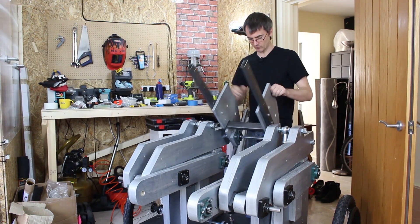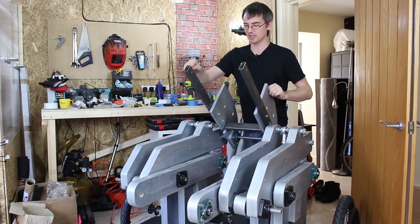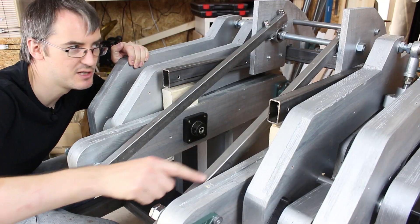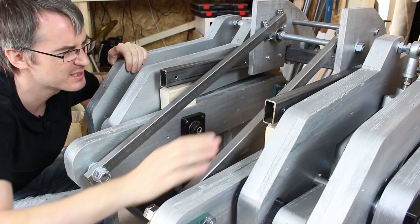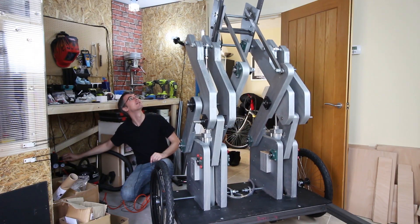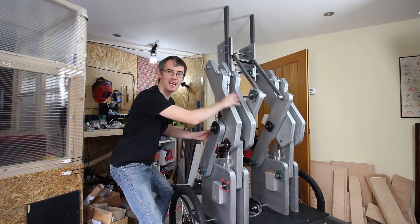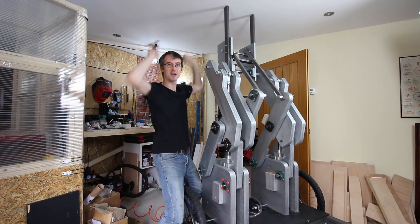That's now the body piece that lifts up when the whole thing goes up. It's getting pretty heavy, so that's going to make it really tall. This gets pushed up by the bearings at the knees. We've got these two steel rods which are mounted on bearings at the knees and bearing blocks at the top, and those are going to push the body up. It was pretty close to the ceiling — Bumblebee's feet are down there, these are his knees, and he'll have cosmetic panels covering him. This is his waist and body, and his head's going to be up there about another meter.